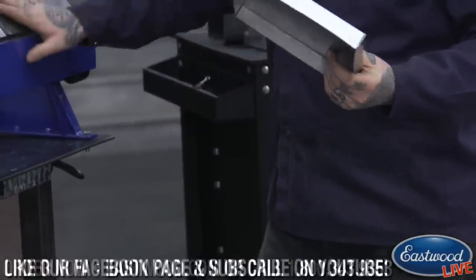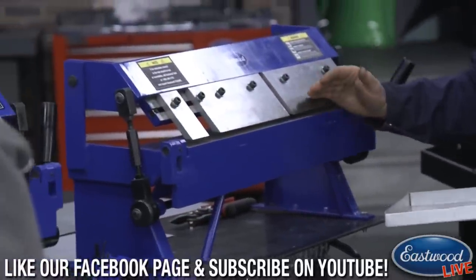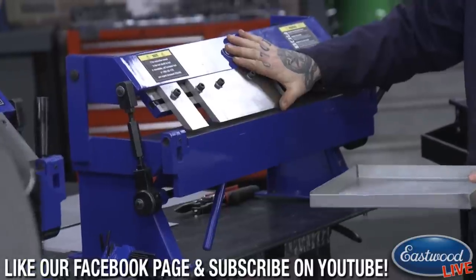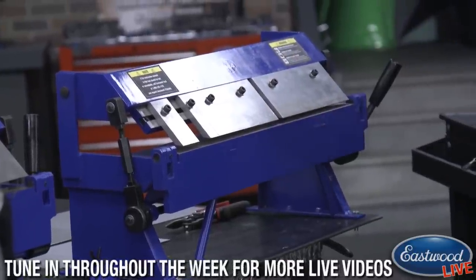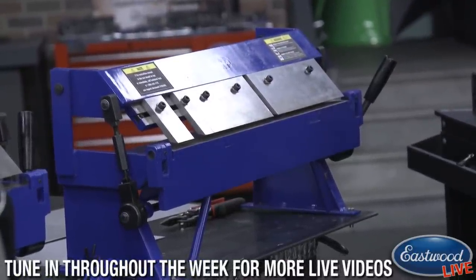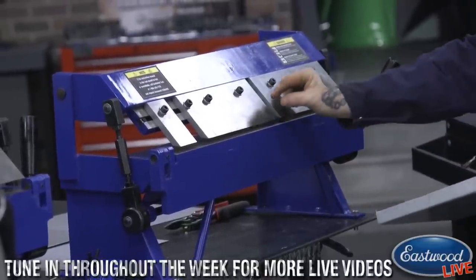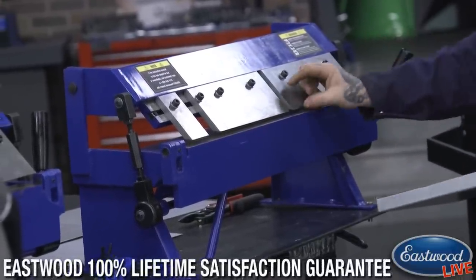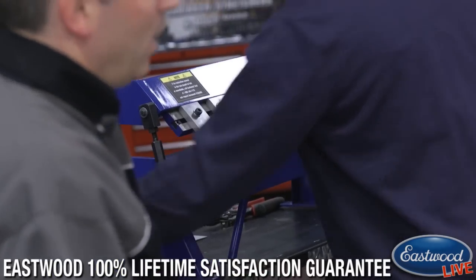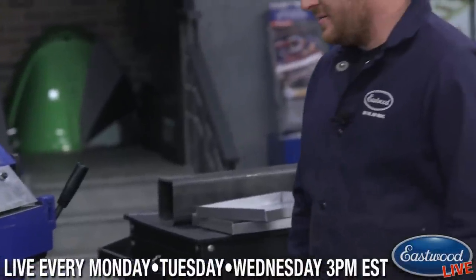This is handy for making boxes, brackets — even complex stuff like box section for an A-pillar that comes around and makes a pinch weld. That last kind of bend is hard to do in a standard versa bend and usually requires a handmade tool, but with this finger brake you can do all kinds of tight bends back on itself. Battery trays, battery boxes, bigger boxes, truck bed floor patches where you've got a bunch of shapes — this tool handles all of that.